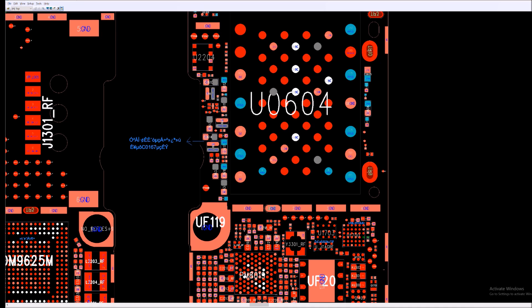In the board view, the component that showed on our FlirCam with the most heat is this one here — that's where the short is probably originating. It's heating the rest of the area because all the yellow-labeled components are connected to this component. The reason I suspect this to be the bad component is because it has the most heat. I did not see any heat on the NAND chip itself, so I can assume the chip is good. Right now, the only suspect is this component. If I remove it and the short is not gone, I can proceed to check the rest of the yellow-labeled components.